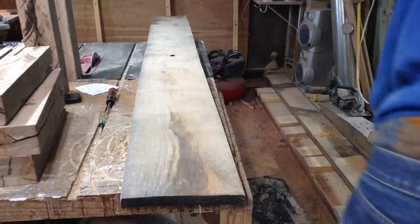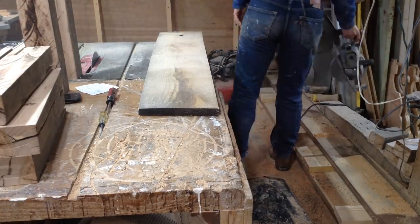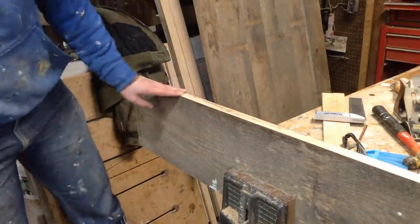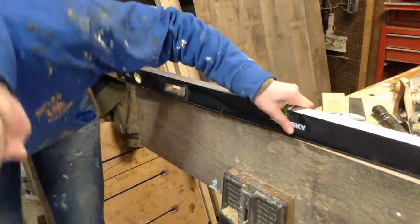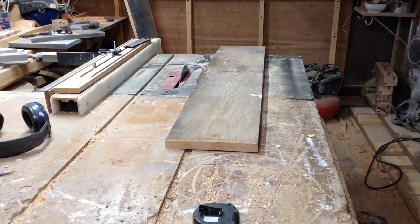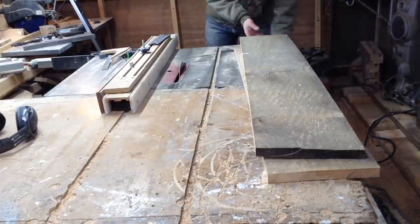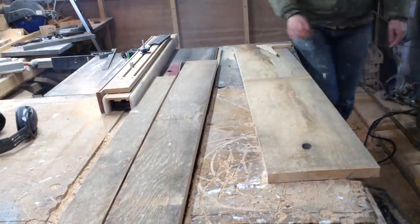This was the last piece of oak I had from my lumber supplier, so I was able to cut the aprons out of it. I have a jointing jig for my table saw but the more I use it the more it's not as true as it was originally, and I didn't feel like remaking it, so I just used a handheld planer to get one edge straight using a long level. This worked really well — with one edge straight I could rip the other edge straight and true up the boards. These boards have a pretty severe cup on them so I was extra careful sending them through; twisted and cupped boards are why building rustically is extra difficult, because you're sending boards that aren't flat through the table saw and that's when accidents happen.